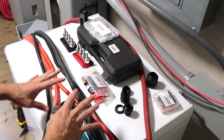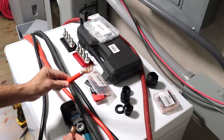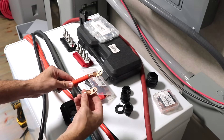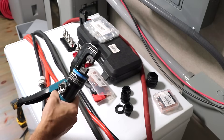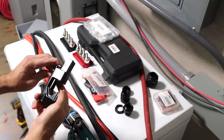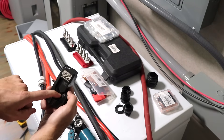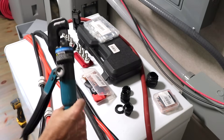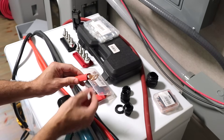I really want you to take care when crafting your cables — make sure they are the proper size and insulation rating. Please crimp your lugs or cold weld your lugs onto the ends of your battery cables. You can do that with a crimping machine like this — they are not expensive, I paid about $75 for mine. I also used an impact crimper first which uses a hammer blow to crimp the lug — that was about $12. There's no reason not to buy one. Also make sure you use heat shrink to protect the lug area.